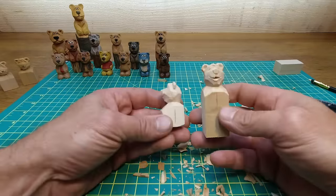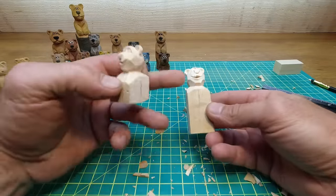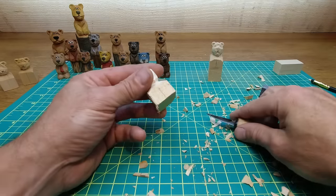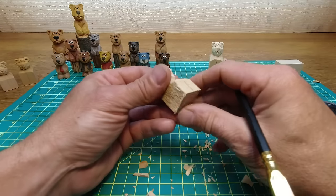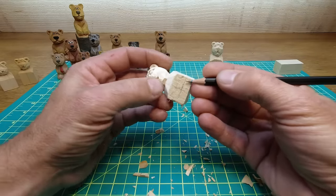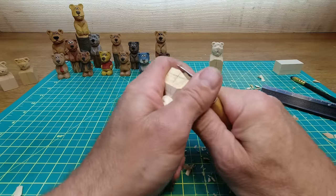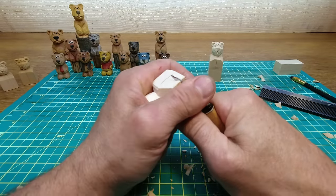Okay, with our pieces cut here, 2 inch, 3 inch, this can be any size, doesn't really matter if it's 3.5 or 2.5, doesn't matter. Let's start with the body. All right, so all we're going to do here, cut straight? Yep. Okay. The fuzz is holding it up. Just about 1/4 inch on the front side. And then you're just going to raise it up to about 3/8 on the back side. All right. All we're going to do is set the feet in place. All right.